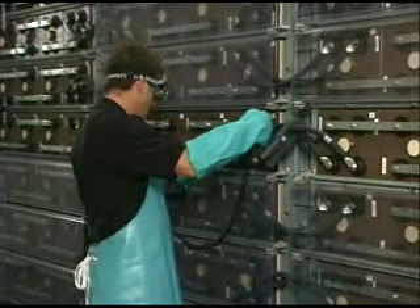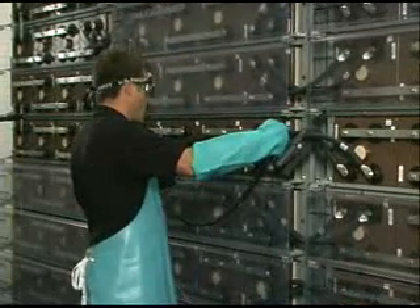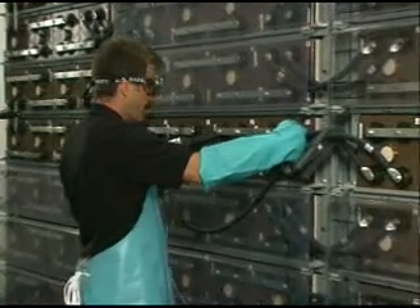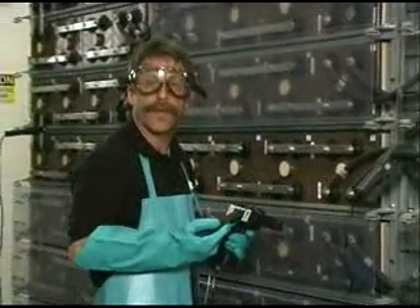You also see the CT that's measuring the current in the string. And then the last intercell connector — because each cell has to be associated with an intercell connector. And we continue with the rest of the string, measuring all the way down through all 24 cells.